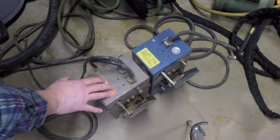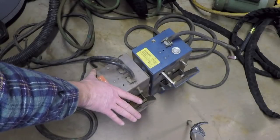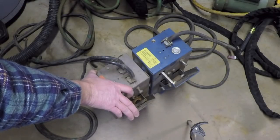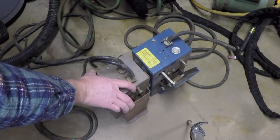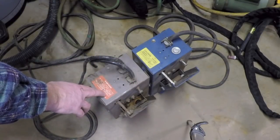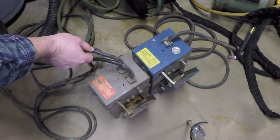One thing the pedal does is it has a switch inside, and when the pedal is depressed, you can actually hear a click. When you start to depress the pedal, even the slightest amount, there's a click. That closes a switch, and that switch will stay closed no matter how far down I press the pedal, until I back off almost completely, and the switch will open. So essentially, it's an on-off switch inside there. The second job that's being done, so one of these cables is strictly for on and off. It's either making connection or breaking connection.